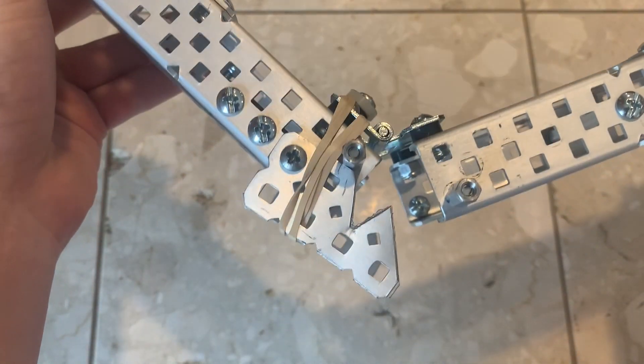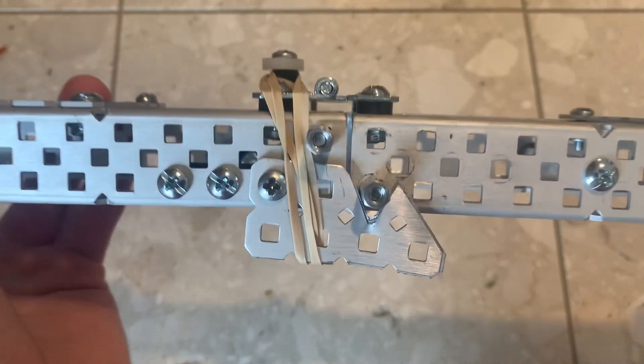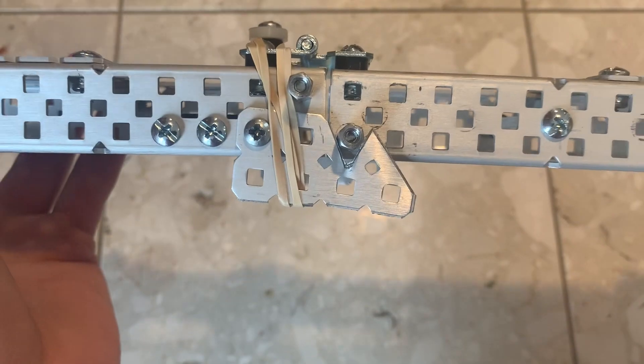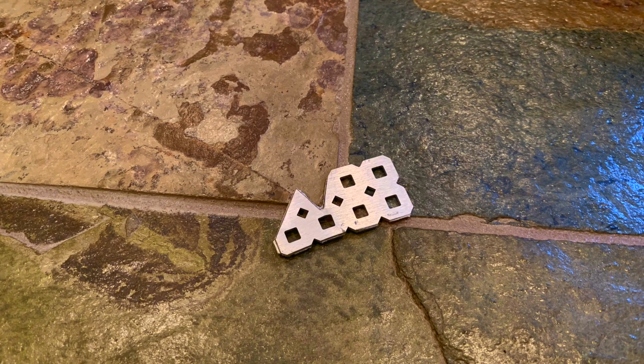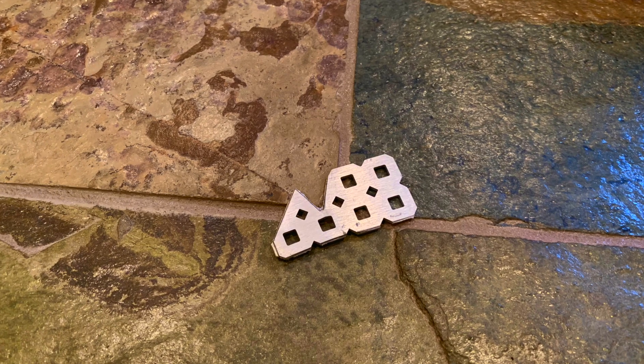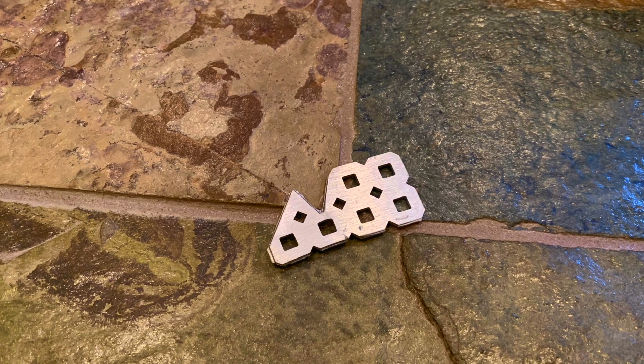While there is a noticeable gap between the bars, the notch does a really good job of mitigating this gap and preventing much slop. While this looks complicated, it actually really isn't — this was made by eyeballing it using a bolt cutter and a pair of needle nose pliers. If you have access to a laser cutter, or if VEX allows 3D printing in the future, you could always use technology to make these perfect.